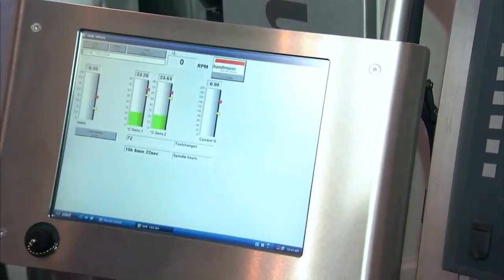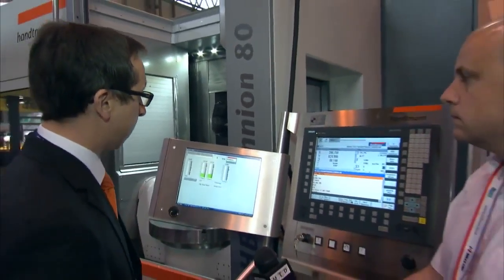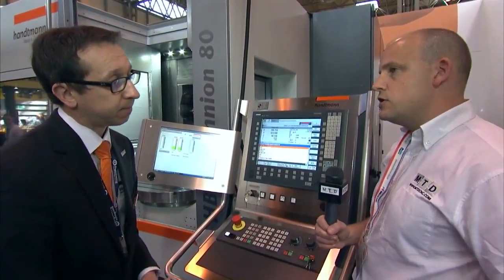First is vibration, which is most important if you're going with high RPMs. You've got the temperature of the main bearings, the load, the power and the speed. The machine has thermal compensation, so everything will be compensated in order to maintain precision. We've got different alert levels, so you get real-life data in real time. The operator gets a warning, or we stop the machine if you overload or get a higher level of vibration — protecting the lifetime of the spindle.